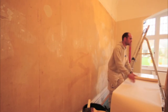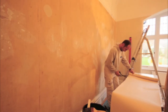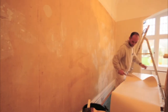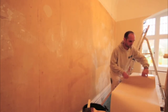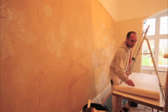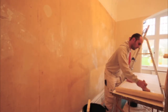On my pasting table I've already marked out measurements in inches. I've rolled the wallpaper along to the measurement I want to cut at, remembering to add on those extra couple of inches, and I've cut it. Then just fold it over a couple of times to make sure it doesn't flip back when you're pasting. Don't push too hard because it will make an indent in the paper — you don't really need to push hard at all to make it lay flat.